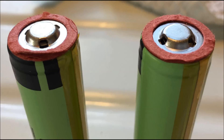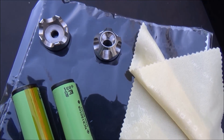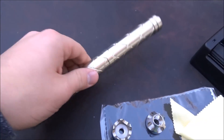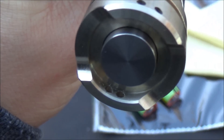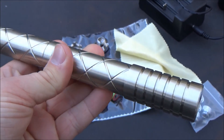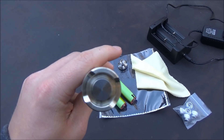I also had a small issue where the little plastic rings peeled off the top of the batteries, though it didn't affect battery performance. Another issue is that the batteries are an odd size — slightly longer than standard 18650s — so normal 18650s won't work in this host. I also sometimes had a little trouble doing the half clicks, where it would stay stuck on the same mode. As for the duty cycle, from a completely cold start I found the laser became too hot to handle after about two minutes of usage. After sitting it down for a couple of minutes to cool, I'd get about a minute and a quarter to a minute and a half before needing another break.